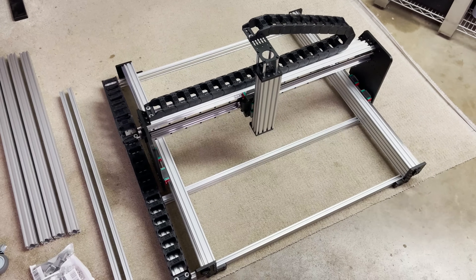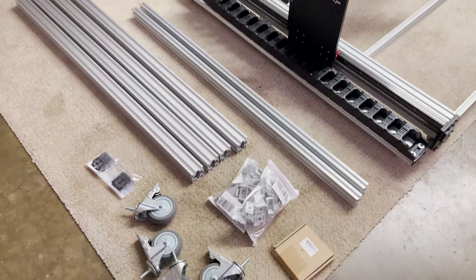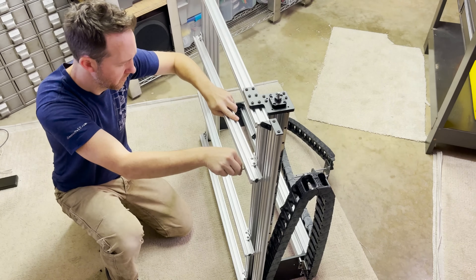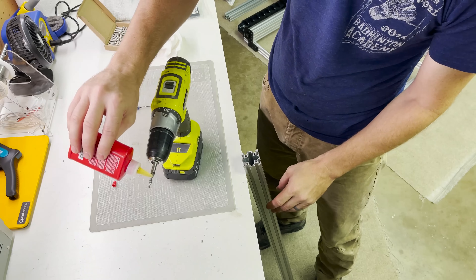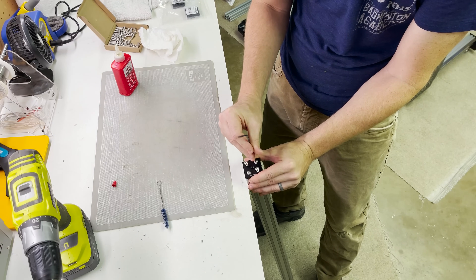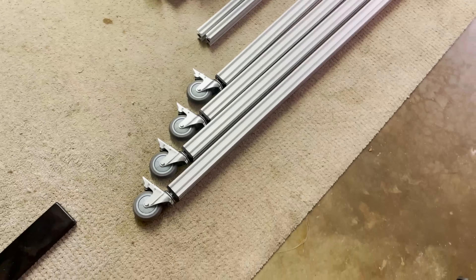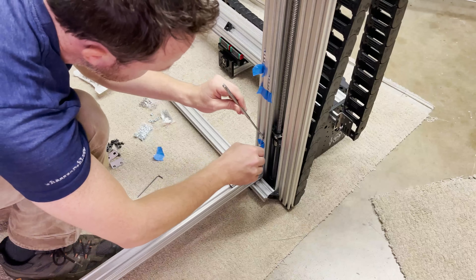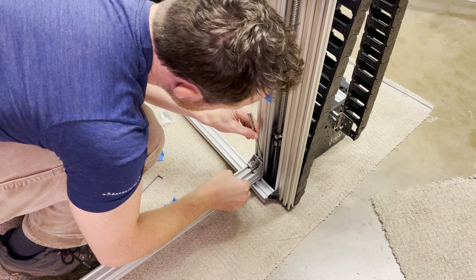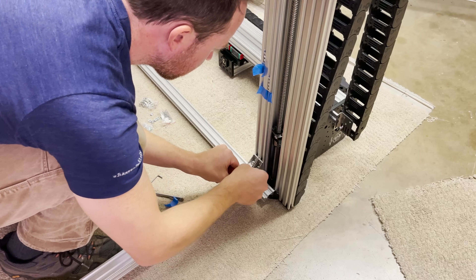For here, I'm just going to start with the modifying of the kit. I bought 4 pieces of 40-40 extrusion and 2 pieces of 20-40 extrusion, and a set of casters and footplates, and some corner bracket hardware. I start by removing the spoiler board extrusion so I can reuse them in the frame. Next I tap all the holes in the 40-40 extrusion so I can mount the footplates for the casters — the footplates attach with 4 M5 screws. With the casters installed, I move on to attaching the legs to the gantry. I stood the gantry up on end and used a magnet and tape to delicately lower the T-nuts into position to attach the corner brackets. It would have been much easier to just use drop-in T-nuts, but they were already there from moving the wasteboard extrusion so I thought I'd use them.